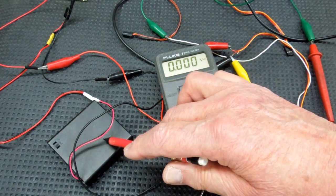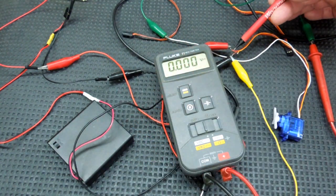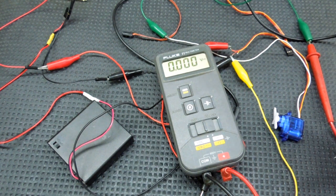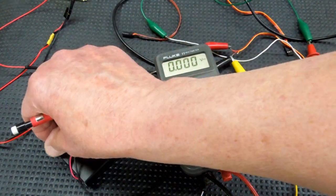In this maze of wires, I have a 5.5 volt battery pack with positive connected to the red wire for the servo, negative connected to the brown wire. The signal wire is not being used. The white feedback wire is connected to the red lead from the multimeter, and the black lead is connected back here to ground.